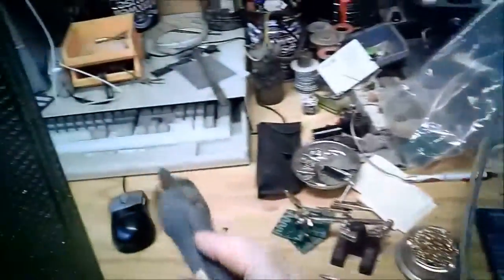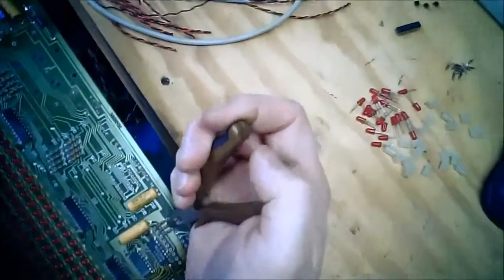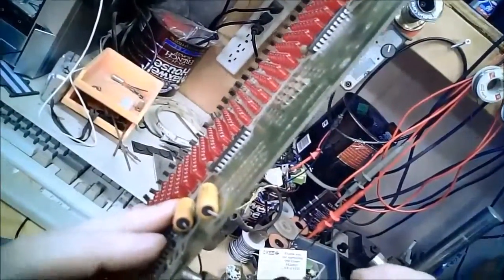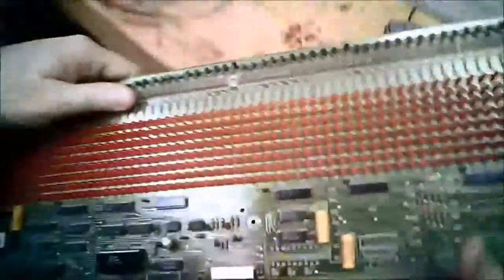This is really common today in processors. So your 2.5 gigahertz processor might have actually been a 3 gigahertz processor, but Intel didn't have orders for 3 gigahertz, but they had orders for 2. So they just took a 3 gigahertz processor and marked it as a 2 and shipped it out the door. Because it'll work perfectly fine as a 2, it's just you're not using all the capacity, or all the performance the silicon had to offer. And that's what a lot of your overclocking crew banks on, is they're like, hey, Intel tests these higher, or bins some of these parts higher than what they're actually selling them at. So if I sit there and tweak my system, I might be able to get X% more performance out of the same part without paying the premium for a part that's guaranteed to go that fast.